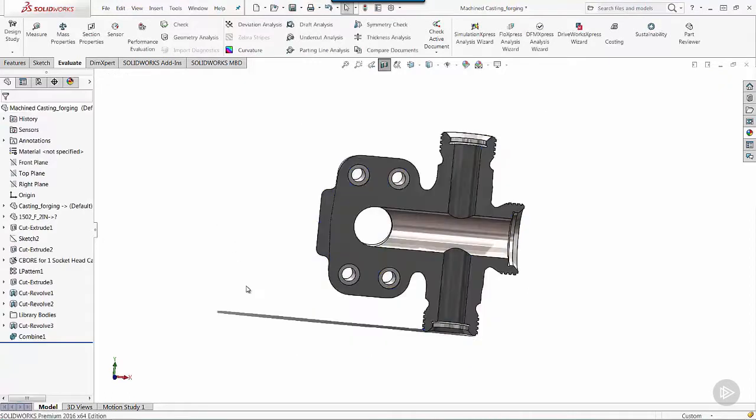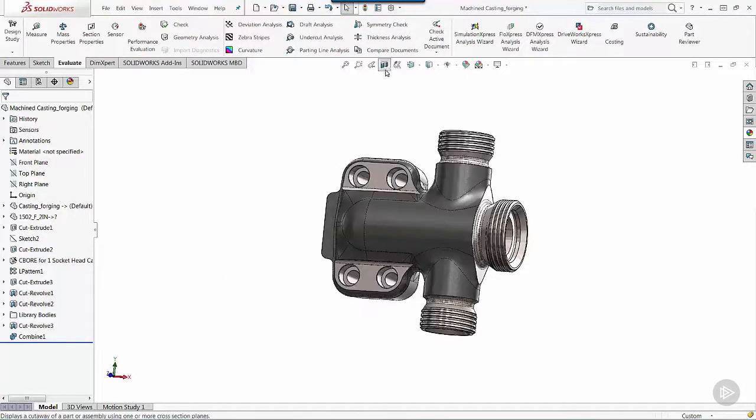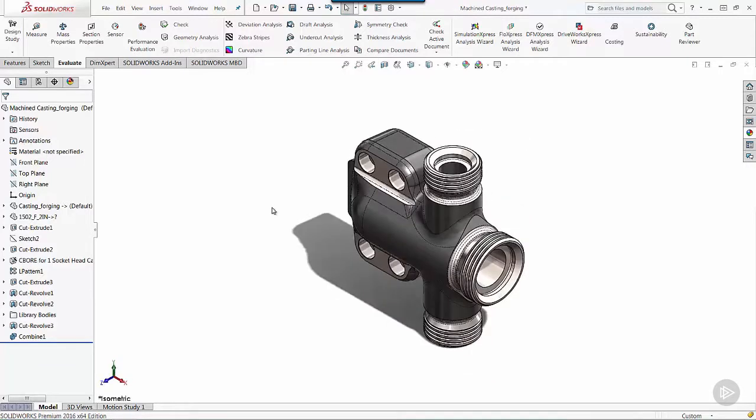What this gives you is a very manufacturable or very repeatable process. I'm actually emulating the manufacturing process while I'm designing these parts in SolidWorks. And one of the things I've taught my students over the years is that you should model it in SolidWorks the way it's built in real life, and do that as much as you can. In doing so, you're already testing the manufacturing process before you get there, and you'll be a better designer having known the processes that are being used in order to create your geometry.